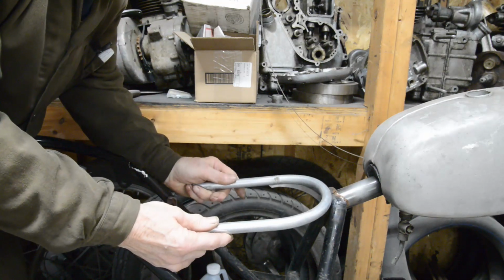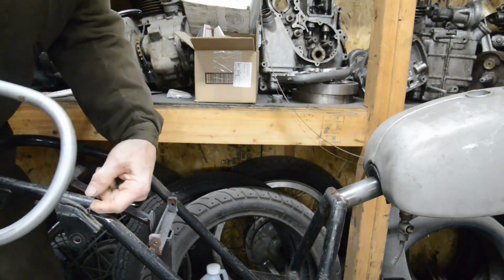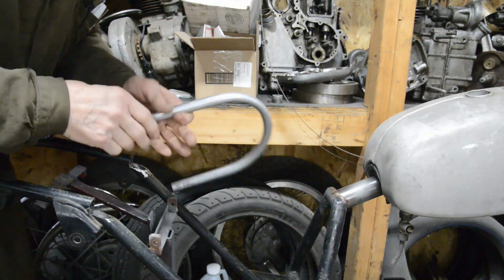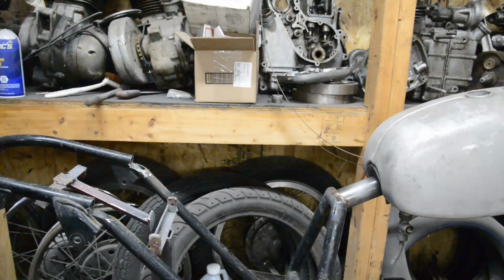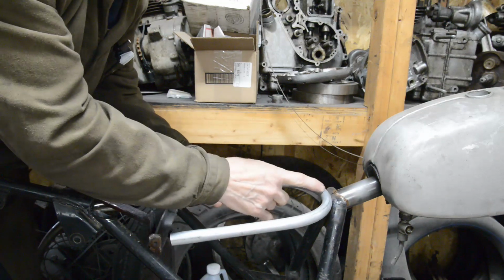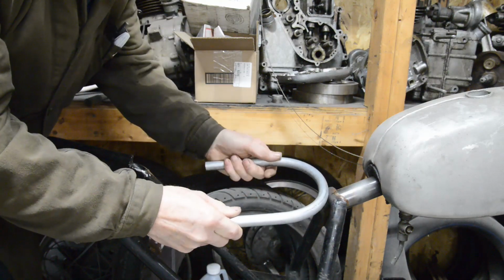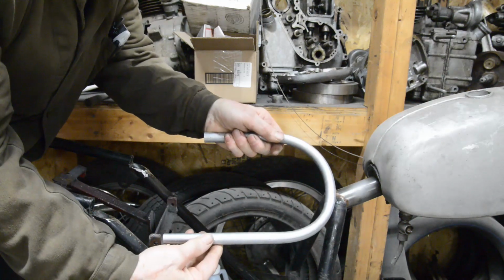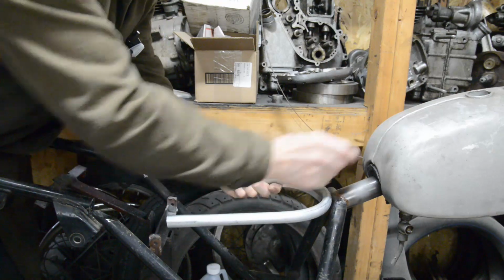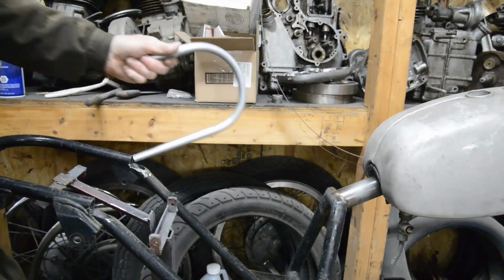And what I think I'll do, because I want to put a sleeve in here to sleeve this. Now obviously if that's going to go there, it's going to be up against, whoa, that shocked you, didn't it? It's got to be up against there. So I think when I've cut this, or bent it I should say, I'm going to cut it in two here, and then that way, if you imagine that part's not there, I can put this onto the sleeve and then just turn it down into there. Then the two ends will meet, they'll get welded up, and they're still pressing into that. So let me measure this, cut it, and then we'll see about doing the bend.